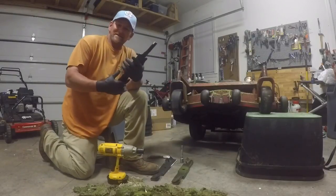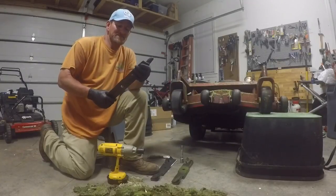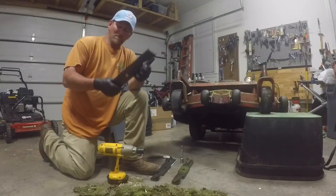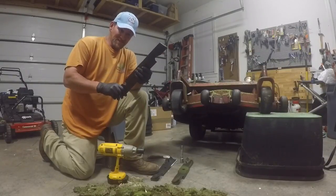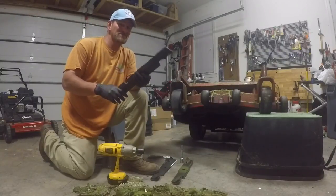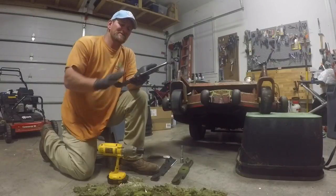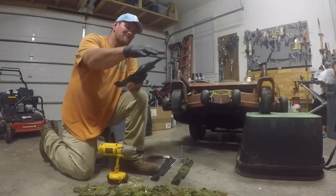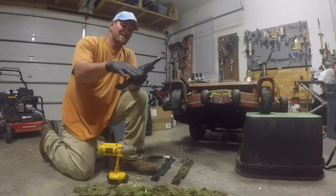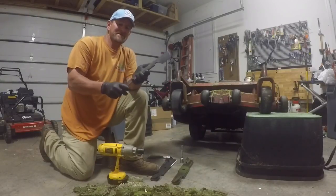The Magnematic — for commercial guys, get one if you don't have it. Spend the money and you'll love it. Homeowners, try to find a shop that uses a Magnematic — it's a great tool. It works well on straight blades, but I'm not so sure about residential-style John Deere tractor-type mowers with the curvy blades. You just have to do the best you can.